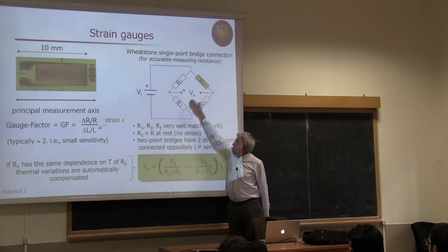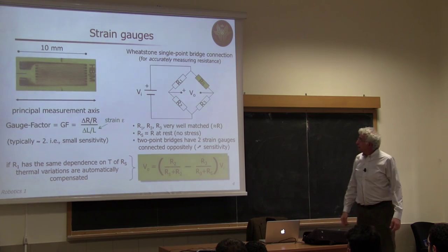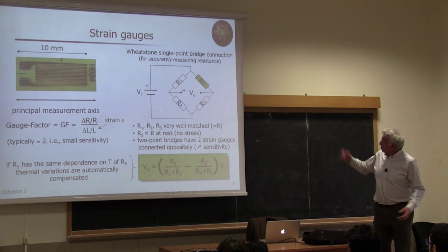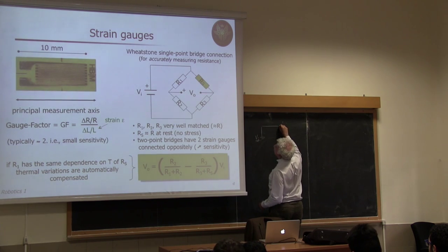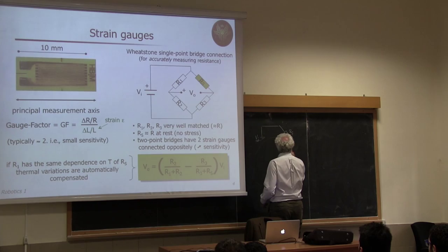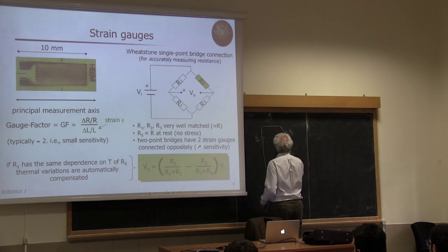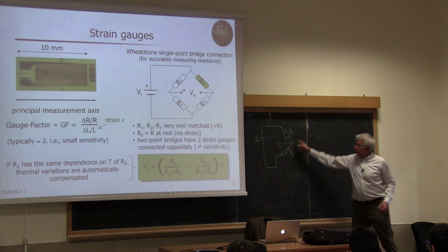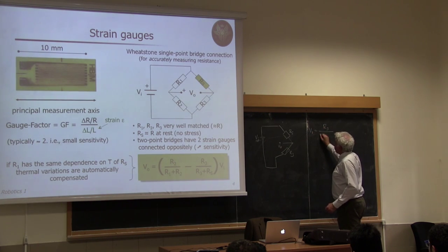For those who don't know this structure: suppose you remove one branch and apply a constant input voltage V_i. You then have a partition of resistances. To understand how it works, start with a simple partitioner: with two resistances R_S and R_3, the output voltage V_out equals R_S over (R_S + R_3) times V_in.